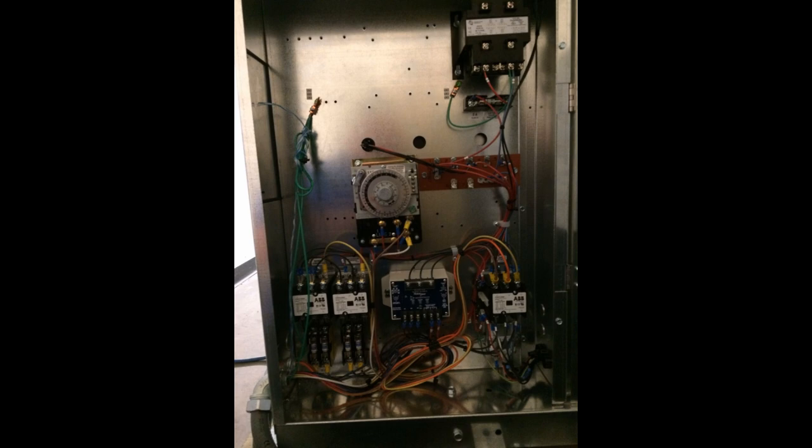So the nine wires going into the coil are going to be two off of one of those contactors that are going to be for my fans, two off of the other contactor that are going to be for my heaters, X-terminal off of the time clock, which is going to be my termination switch, which we'll talk more about, N off of my time clock, which is one side of my 208, one off of my time clock, which is the other side of the 208. Number three, which is my heaters, is going into my coil, but also going to one of those contactors. Number four is going into my coil, which is my fans and temperature control. It's going into the coil and also to one of those contactors.